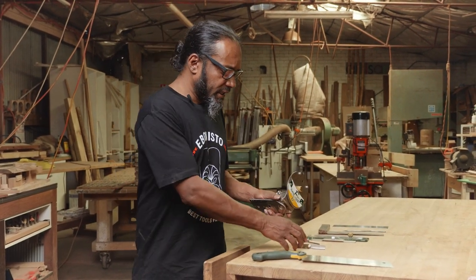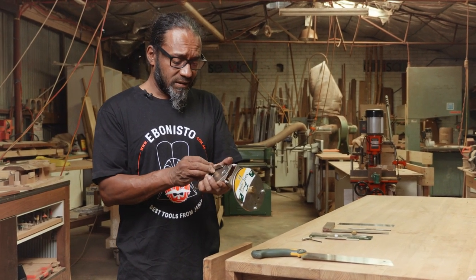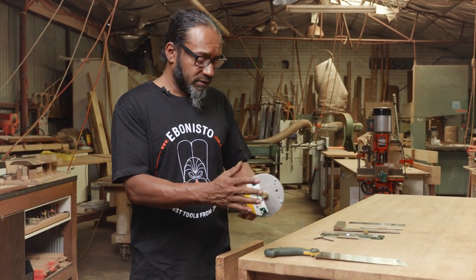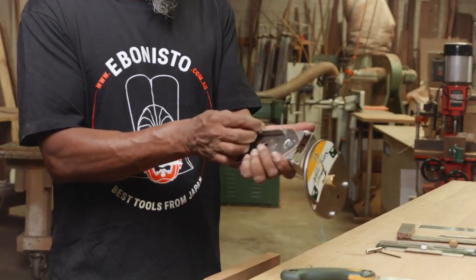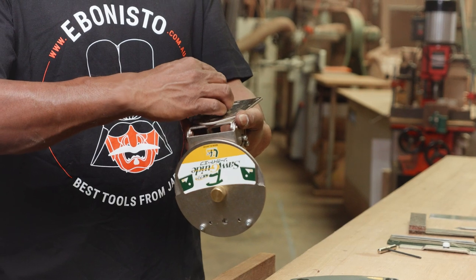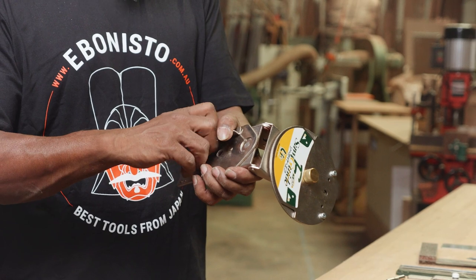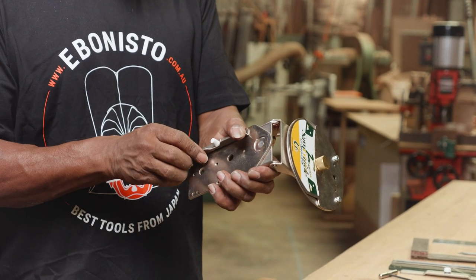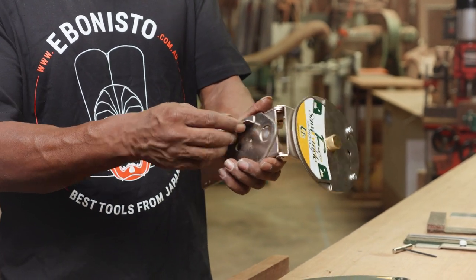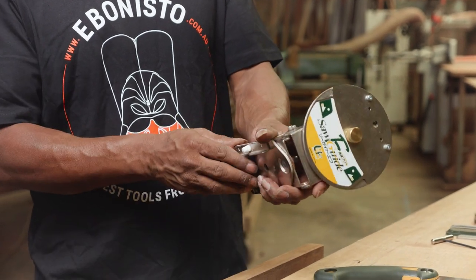Let's start off with the 90 degree cut, which is the most common cut that we all need to use — 90 degrees is the angle we need for cuts most of the time. So this is the cross cut fence here. If you're left handed, you could put it on the other side and use it left handed. I'm right handed, so I'll put it over here. It detaches like that. It's a very firm fit because it's indexed there with two little metal stubs and then the screw holds it in place.